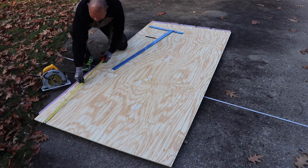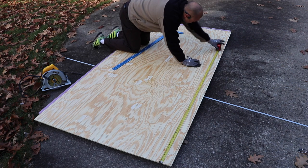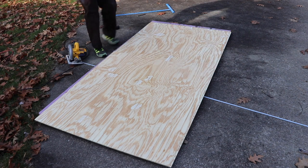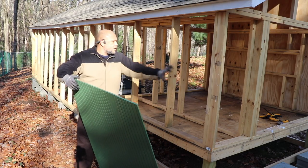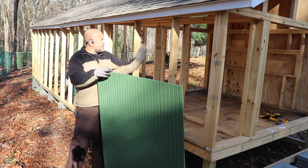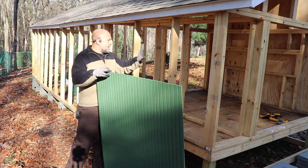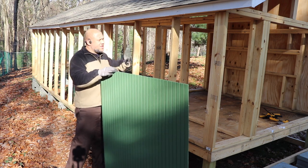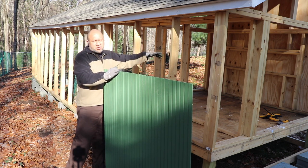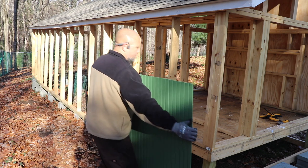It's the second piece to the back side of the storage area. And now I'll paint it. I don't care that this board isn't going to overlap on that 4 foot side, because these doors are all going to be framed out. I'm going to cut out this opening and make swing doors out of each of them, and these half sheets, it'll make a little more sense hopefully when I put it up. These half pieces will be mounted to the door frame, so I don't care that they're not lining up to connect on the studs.